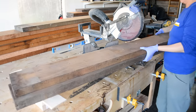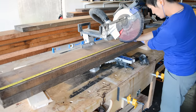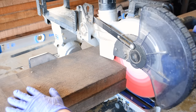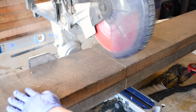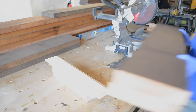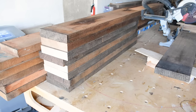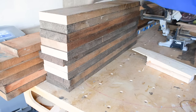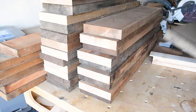At the lumber yard I found boards at seven foot lengths as well as some eleven footers. I had already decided to make my hot tub three and a half feet tall before going to check what was available. Luckily, having seven footers made it easy to cut many three and a half foot staves without wasting material. If you're going to build a hot tub, I highly recommend checking to see what lengths of wood are available to you and designing around that.